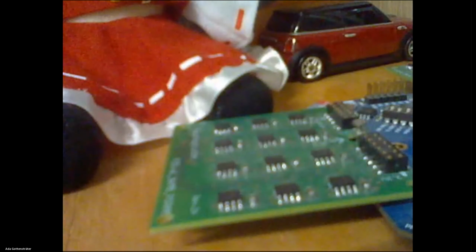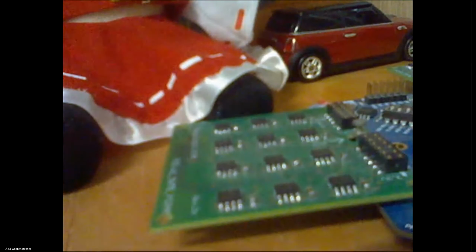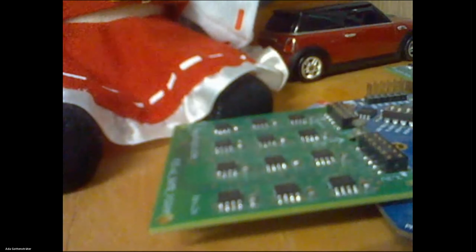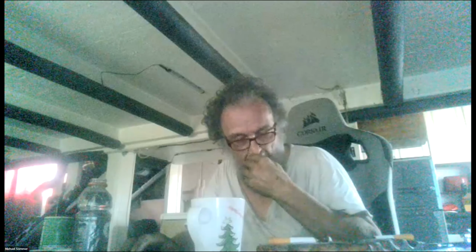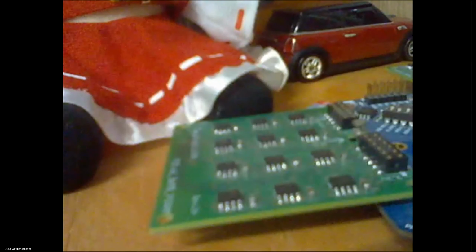I did want to build a USB analyzer thing, but I never got around to it. I do have the parts laying around. Basically I wanted to make something I can plug in between and connect my questionable quality logic analyzer to, and have it sample all the pins. Even these cheap logic analyzers have 24 megahertz bandwidth, which is enough. Yeah. And then you could use a USB decoder on the PC and look at what is actually happening. You vaguely know what's happening on your own driver, but you maybe don't know what's happening if you plug it into a PC, right?